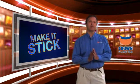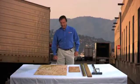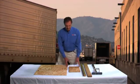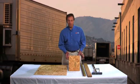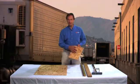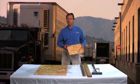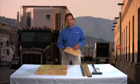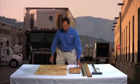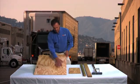Today we're going to be discussing some of the ins and outs of bonding to wood. Now as you can see, wood can be very challenging on a number of fronts. Number one, wood is very porous. Typically pressure sensitive systems are not going to work very well with porous substrates. You also have a lot of different textures. Here for instance we have plywood — fairly smooth, but you're going to be dealing with knots and voids and so forth.